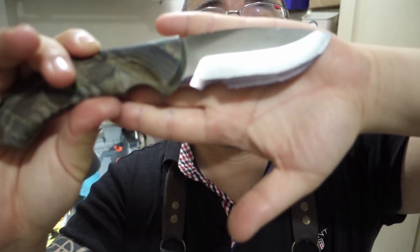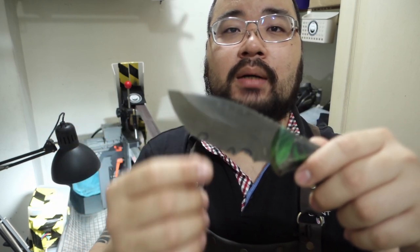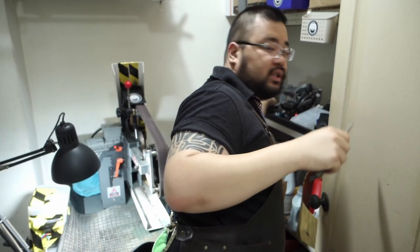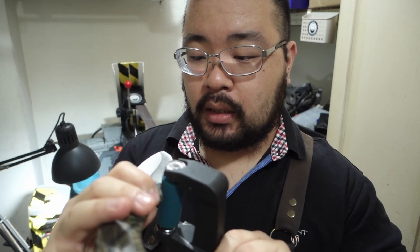So this is the fix I came up with. I've marked out in sharpie where I wanted to remove material. Initially I did want to give this a bit of a recurve, but because of where the stress fractures were, I couldn't do that anymore — it wouldn't be as economical. I wanted to retain the choil, so I've marked up with sharpie where the choil would be. Using just the belt grinder won't work — the wheel's a little too big and won't give the suitable radius. I've got one of these smaller contact wheels, and we have attachments for even smaller ones, which we can use to make the finger choil and bring back the function the original design had.